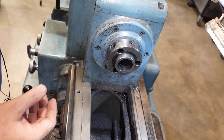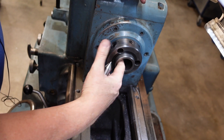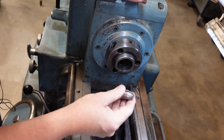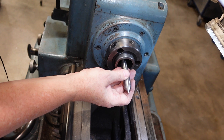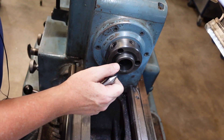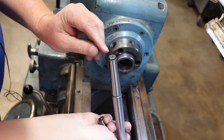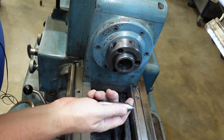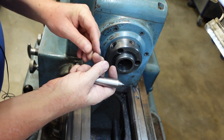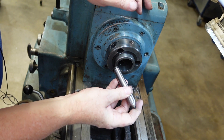This is where it all starts. The way that lathes used to be run was with a centre — you'd put a centre in the headstock, a centre in the tailstock, and in the ends of your workpiece you'd have centres. It would sit on those and you'd be guaranteed accuracy; the axis of the centres would be accurate to the axis of the lathe.